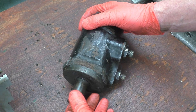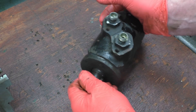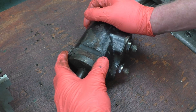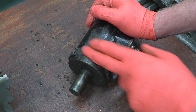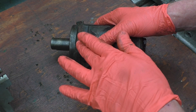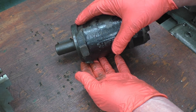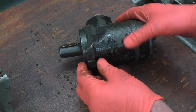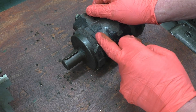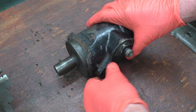This is a hydraulic pump from some sort of metal torching machine. What's happened is the mounting lugs have snapped off — they've been welded back on a long time ago and snapped off again. To do the job properly it would mean stripping the pump and building it all up again, which isn't really worth it. What I think I can do as an easy fix is mill a flat in there, then make two plates for a nice fit, and the clamping bolts will hold that in place.